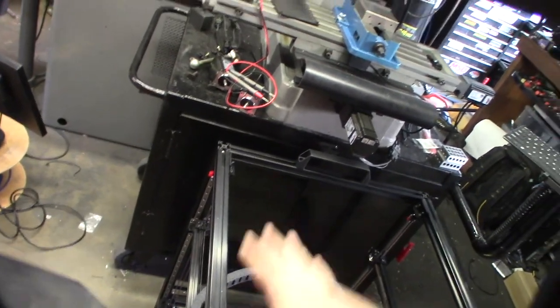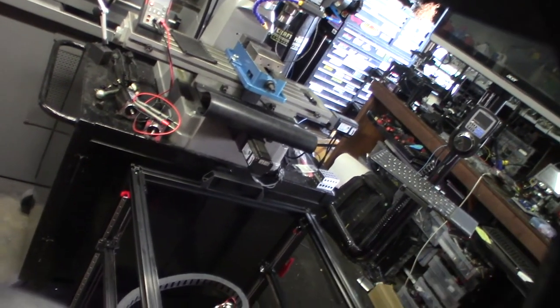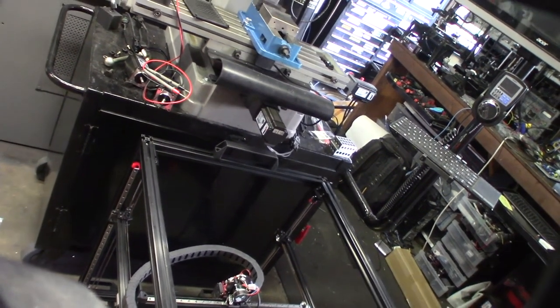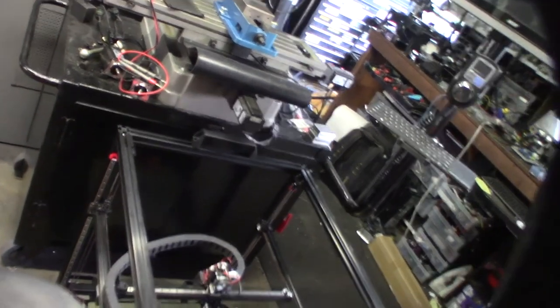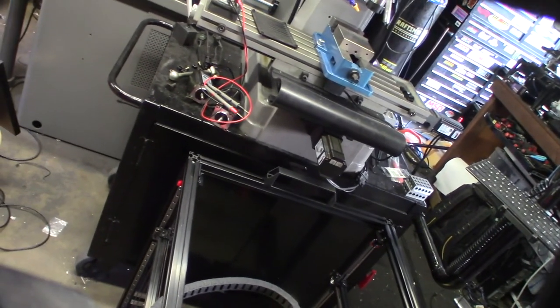So that's how you do an AC heater bed. The board came today for this printer, so my next 3D printer video will be getting this thing back to life. The guy didn't even use it - it came from China, he started leveling it and it just crapped out. The board died, but he has replacement boards. The boards themselves are fine - the drivers are bad. It killed 7 drivers, which might have shorted out. Those are proprietary drivers you can't really buy separately - it's like a clone of the Duet board.